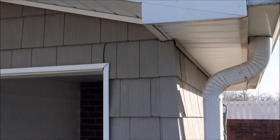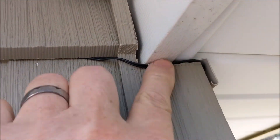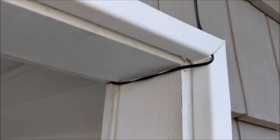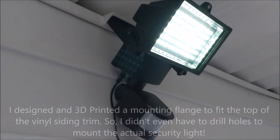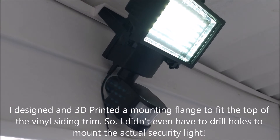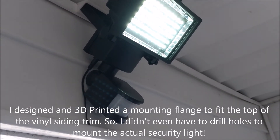No drilling through the wall. The wires come out on the other end of the channel near the doorway, ran them up here, slipped them underneath the vinyl siding, and brought it down to the corner of the door. On the inside, they go up behind this piece of trim, lay in this valley, and go over to the security light. The security light is set to stay on for about 30 seconds. It lights up really well down the stairwell and comes on almost instantly when you step out of the basement door. It looks like it's going to work really well.